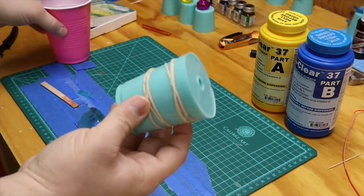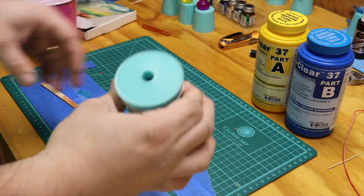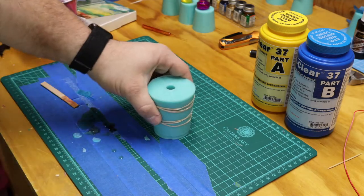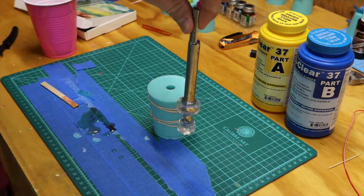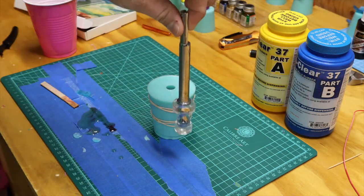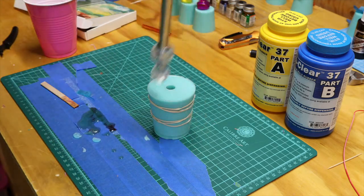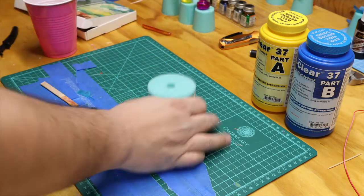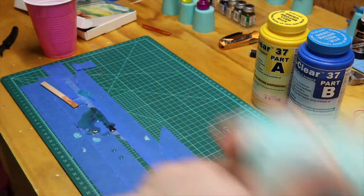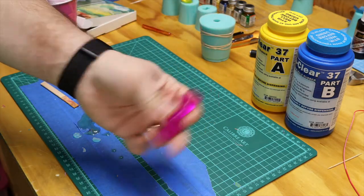Here's the first mold I made. I have some elastic bands around it holding it together. Usually that's not a good idea, but this is a pretty thick mold so it's not really compressing the inside — it doesn't change the shape at all. I made this in a plastic cup, and what I did was I suspended the handle inside the cup from a structure. I'll show you how I made that. I poured in the silicone, let it go in the pressure pot, popped it out of the cup, and cut it down one side. That's how I've been making them.